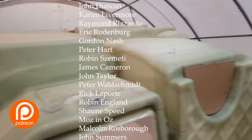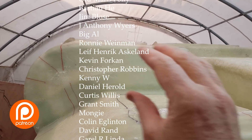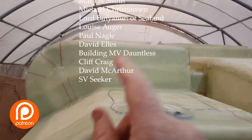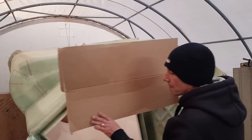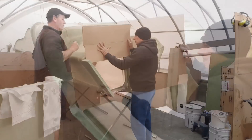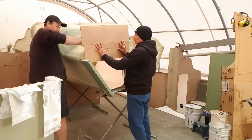The next important thing after the toilet base is we've got to get a piece of foam to fit here — 20 millimetre foam, going to be glued on over the weekend. Come back Monday, glass it, and the module is pretty much done. John's going to help come up with an idea here — we're going to do a quick template off here with some cardboard, jam a piece in, and just copy the shape.